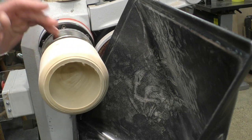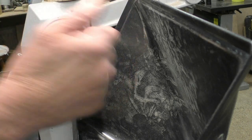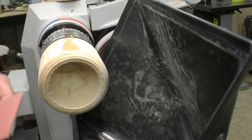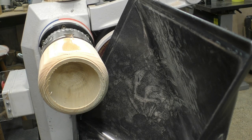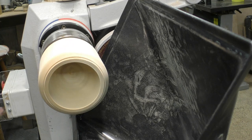Just to end, I'm going to show you how effectively this collects dust — not only from the point of production but also any that goes over the top, which it also drags in. I'll be using 180 grit for hand sanding and also for the inertia sander, which is notorious for throwing dust everywhere. I can't impress enough: when sanding, always wear at minimum a valved face mask, or ideally a powered respirator — some form of PPE in addition to a good extraction system. We'll start off with hand sanding at around 500–600 RPM just for this demo.